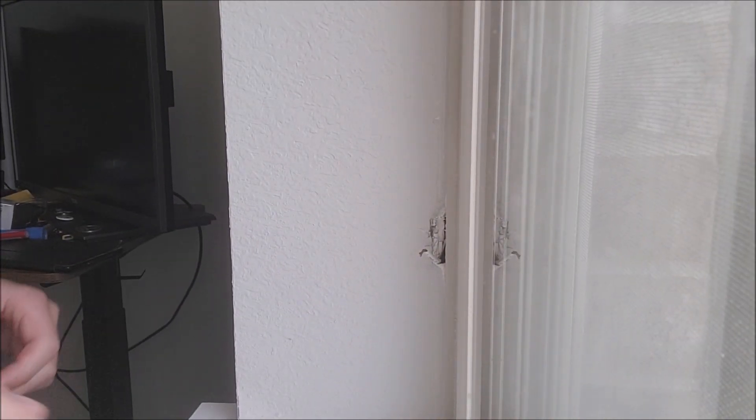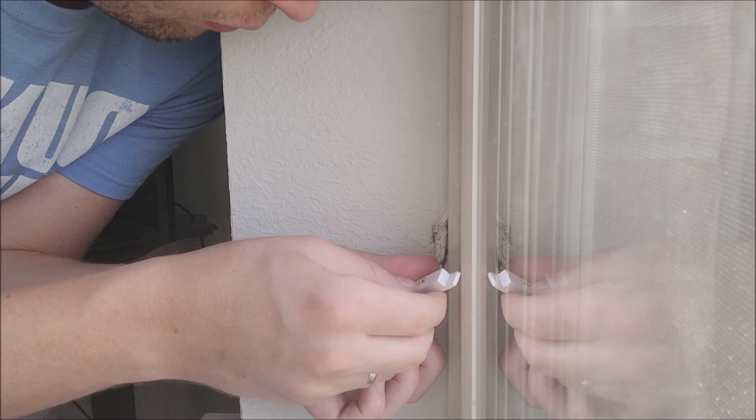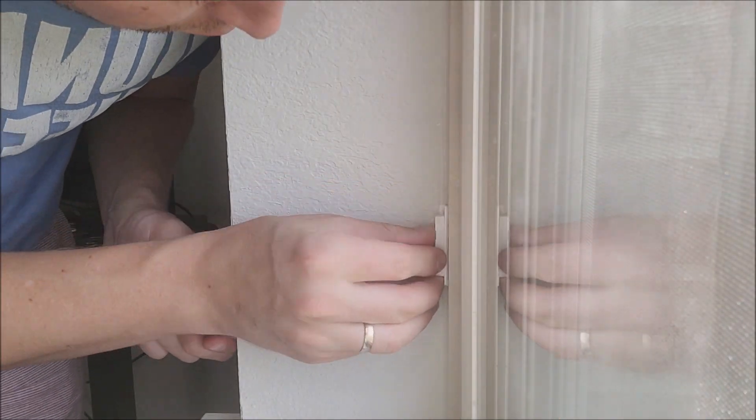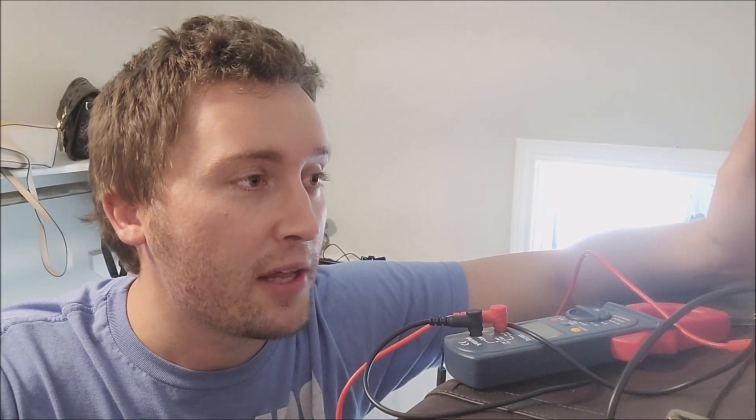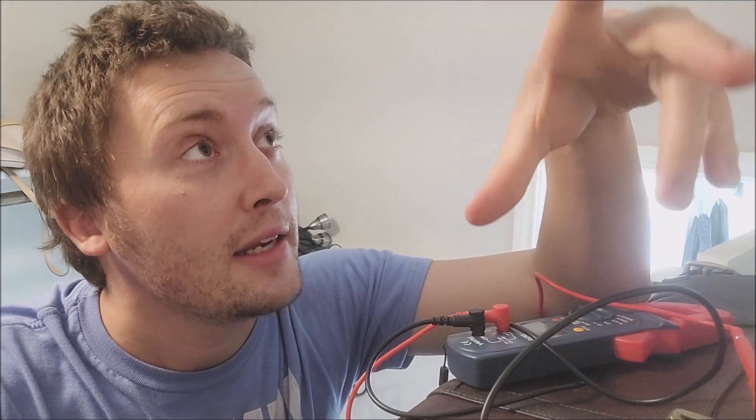Back in the office where we twisted the wires together — you could leave your multimeter connected and disconnect to see if it goes back to open line. Back in the master closet, the sensor is wired in. I did a test to confirm continuity, then slightly opened the window and saw that it breaks when the magnet moves away, which is exactly what it's supposed to do. I'm going to do the exact same process on all my other windows and doors, then wire up the retrofit kit to the zones so Ring can monitor them.